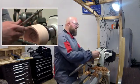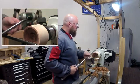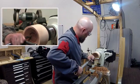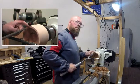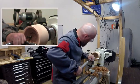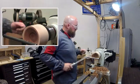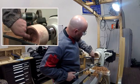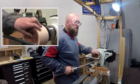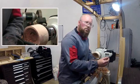This is, I think, like a 1/2 inch bar. I've got a larger bar, so I can go pretty deep with it. You cannot cleanly get the sides, so you actually have to scrape right there. And for that, you use the bottom of the hook down here to do the scraping portion of it. And as long as you use a nice gentle cut with that, it does get a pretty nice surface. But again, we're scraping here, and I said earlier I don't like to scrape. So that's why we have the cranked hook tool.